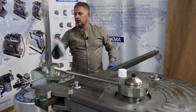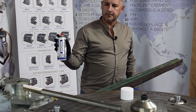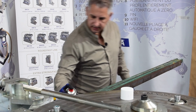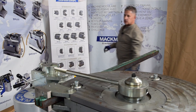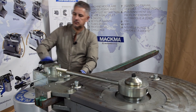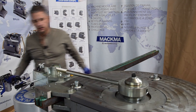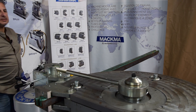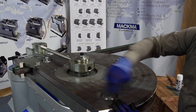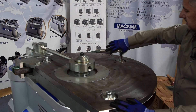For better sliding we are now using grease. We put the grease on the pressure die. Now we close the pressure die and the tie bar. Once we are ready with all the adjustments, we close the bend die — first fitting the screws and then tightening them.